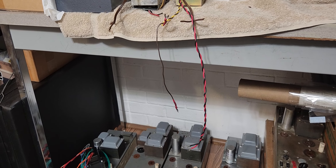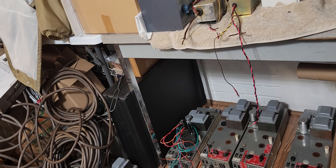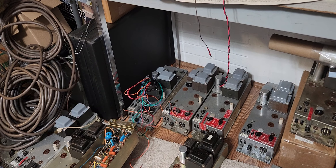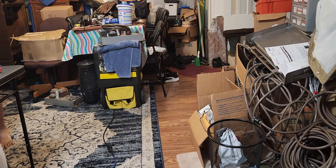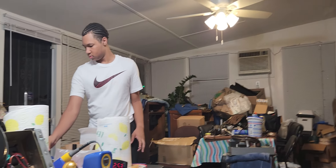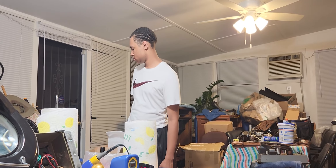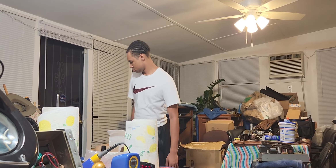Now, you can use the old-fashioned Telefunken, old-fashioned Mullard, the vintage Telefunkens and those Bugle Boys — those are great tubes as well. But these new edition tubes, you have to be careful about them. I played one new one tonight and that thing sounded a little muddy. I changed it out, pulled it out, put in a vintage RCA, and it changed the sound of the amplifier. That's why I ordered some vintage RCA tubes for my amplifiers.